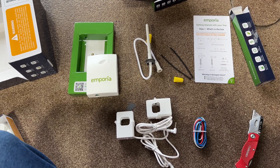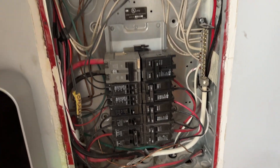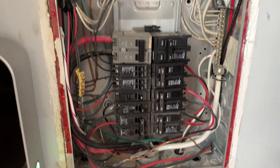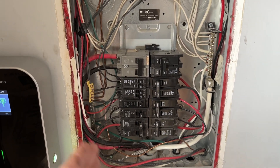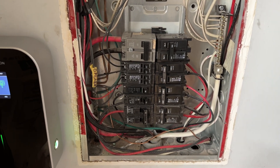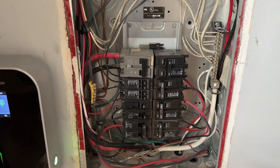I'm going to open up one of my panels here. Here's the inside of my 100-amp service — it's pretty much full with the exception of my upper right. These are the rest of my circuits, and I'm going to be putting those primary clamps on the two main wires. Don't do this live. If it's even legal for you to touch it — which I don't recommend — hire an electrician, make sure the service is pulled, the meter is pulled, your electrical company knows, and then they can retag your meter and turn it back on later.